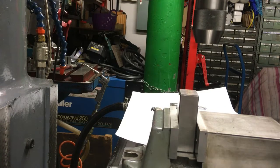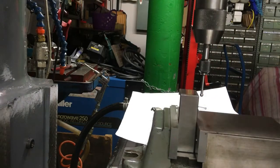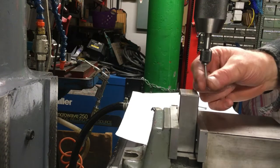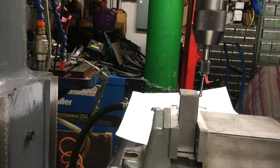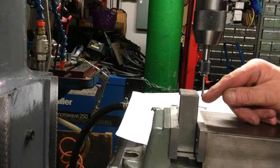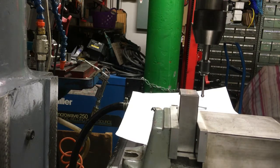I've leveled it up onto the block and I'll put the first wobbler in - lock it up in the chuck. What I normally do is lower the table so that when I'm moving around I don't clatter it into the component or vice jaw. I bring the quill down and run it at between 600 and 700 RPM. As I move it in on the Y-axis, it will be wobbling around, then go very straight, and then flick off once I go over the center of the 5mm ball.